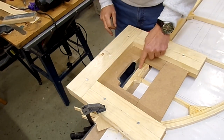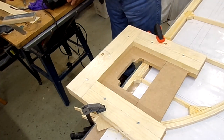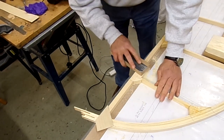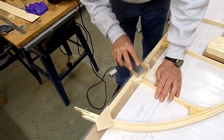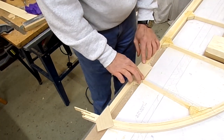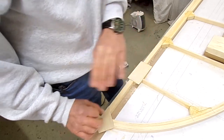I've just routed out this side down to depth, so I'm going to do the side here, then do that side using the guide edges — I'll turn this around and then be able to cut the remainder back that way. Safety glasses are number one priority. Remove the jig, give it a light sand just to get any slight steps out, and hopefully that piece should sit in level all the way, ready to be glued like that.